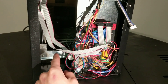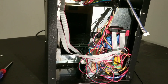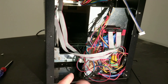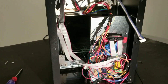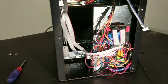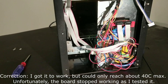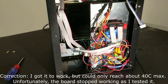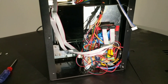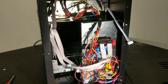I don't have the bed heated right now. This bed used an interesting heater system — it was all self-regulated, a closed-loop heat bed. The printer would send voltage to it and it would self-regulate with the resistor on board. I ended up not being able to use that at all, even with my own thermistor. So I have a 120 by 120 millimeter heat bed that I intend to use eventually, because I think this would make a very good printer for ABS having a closed environment like it does.